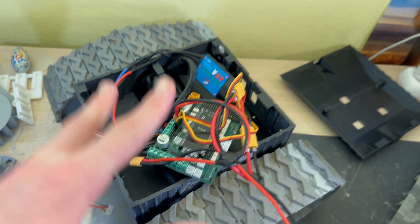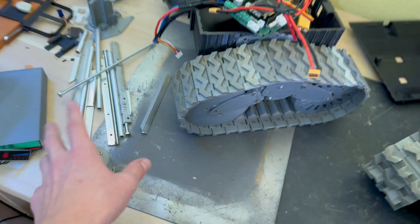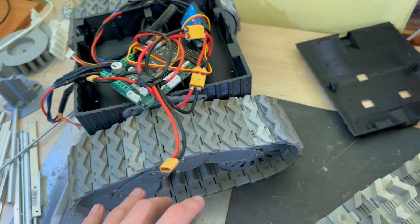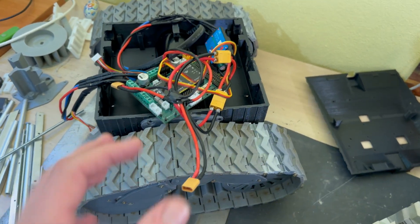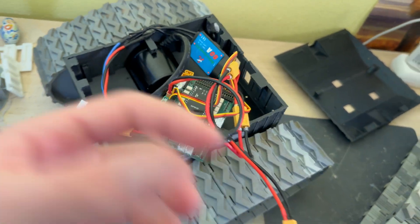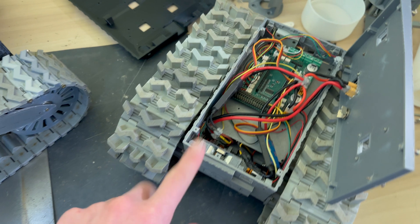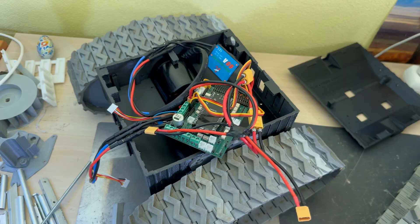That's because these huge motors already come with sufficient torque. The whole point is so that I don't have to switch gearboxes — I can use the exact same drive wheel setup for slow and precise movements, but also for fast movements. For this I needed the big motor so it would feature both high RPM and high torque. The small motor just features high RPM but doesn't have enough torque. This robot has both.